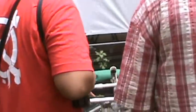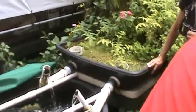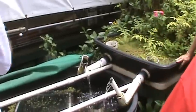One-way valve. The intake is right here. See the water going up and down in here? See it surging? It's sucking. The one-way valve opens. The air's coming in the green hose. Comes over. It's burping up here. I've got this one curved, aiming it with just a little slit to let the air out. So 90% of the water's going that way instead of going up and falling down, right?